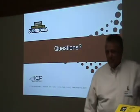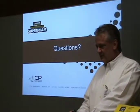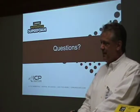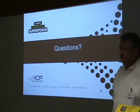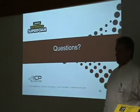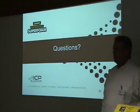You guys were talking about the fire rating. Is there a 1 hour? Everyone's calling about a 1 hour fire rating test when they're building walls. Is there anything like this on there? Yeah, that would be a wall system. So this E84 is the exact same thing as our acoustical sealant. It's also tested, your UL and the E84 is the same test. That's a smoke and flame spread test done in a wind tunnel. And so that's just the stuff itself and not a wall. No. 1 hour and 2 hour, you have to build an entire wall made of this, and we don't have it.